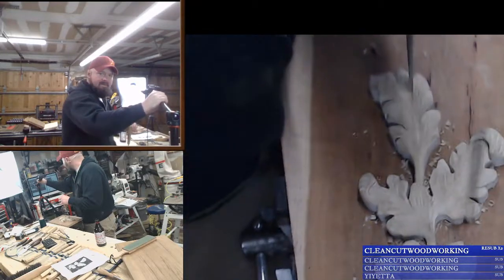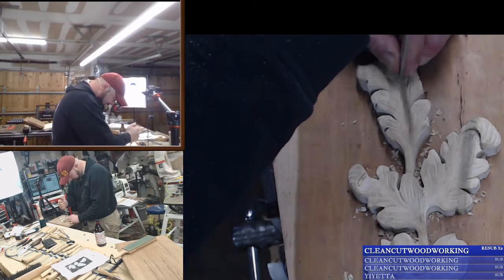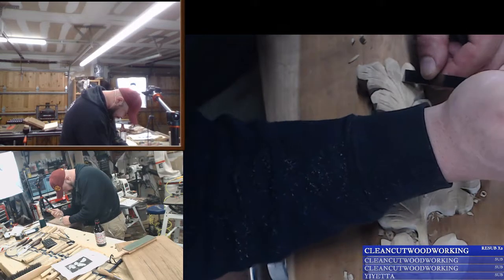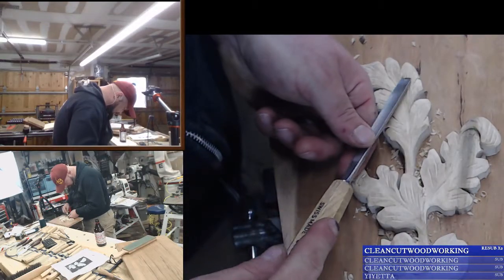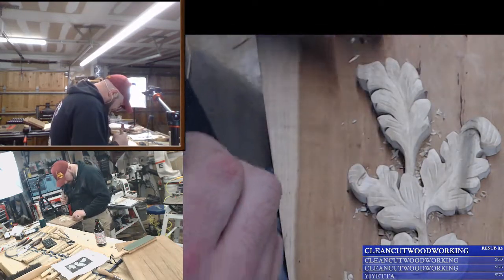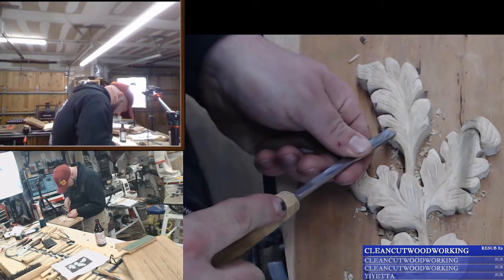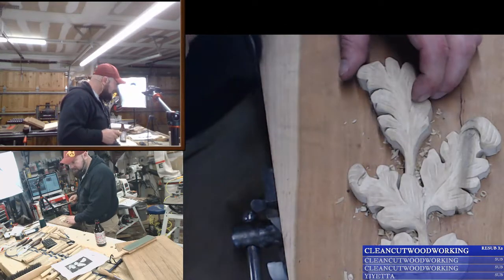And then we're going to tilt the blade like that with the bevel, and then just come down. Now I'm going to go in, take the right cut in here, and then go deeper down towards the bottom. And it has a nice little shadow. Put it on here, put it on here. Go deeper on the left, high on the right. Chip it away. Also called chip carving.